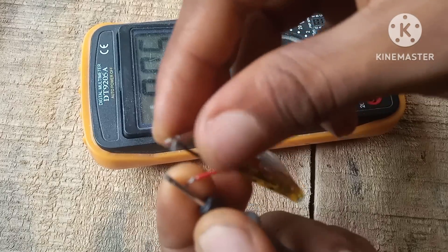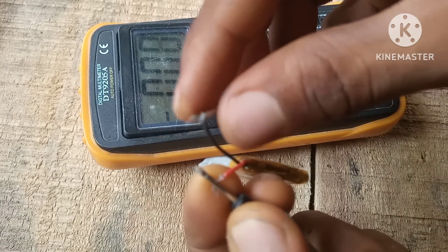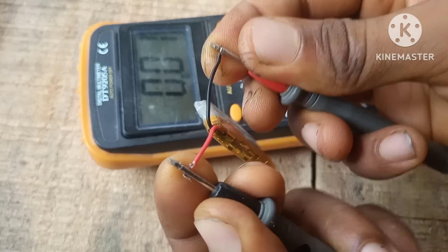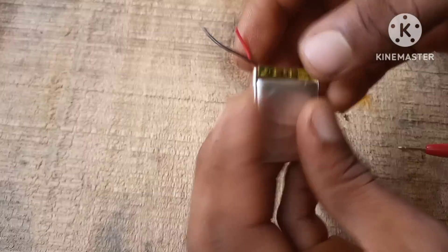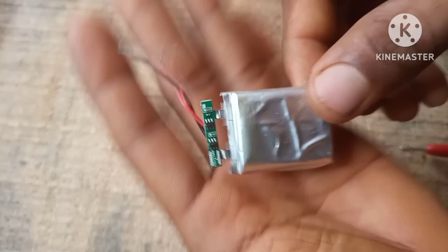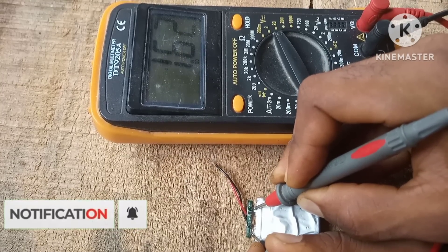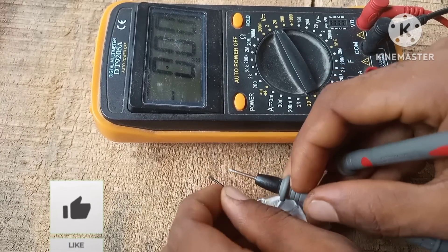As you can see here we have zero volts — that's because we're measuring the voltage on the output of the BMS circuit. Now let's measure the voltage of the battery directly. By peeling the insulation we're able to expose the terminals of the battery. Measuring directly on the battery terminals, we can see we have two volts on the meter. The BMS cut-off voltage was at 2.76 volts, so now we're gonna have to boost the battery.